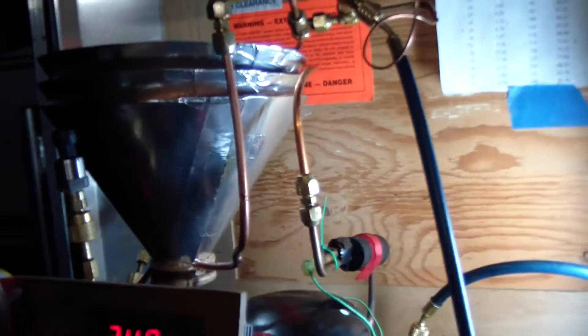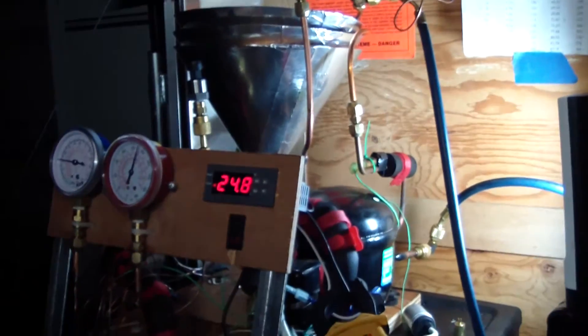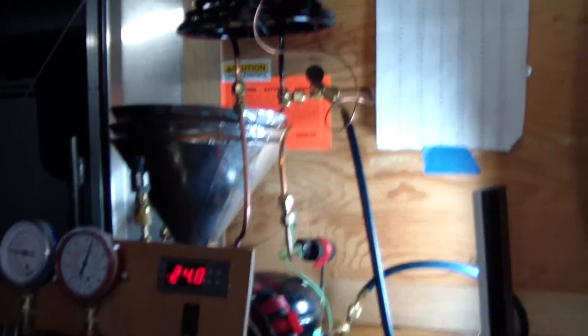For now, I don't have a lot of time to rebuild this thing. I'm going to let it run for a couple of days, get the pressure transducers set up, learn a little about them, and get a better understanding of what's going on in this cycle. Then I'll probably just eliminate this heat exchanger and go back to just the static condenser, even leaving it up high and adding some kind of subcooling loop if I need more surface area. Along with the pressure transducers, go back to basics, and then move back into the evaporator — thinking about a slightly stronger glycol and water solution with a slightly lower freezing point, and also messing with the baffle and the evaporator coil.